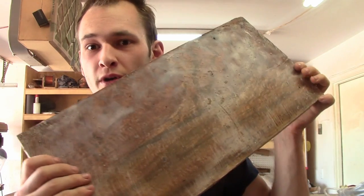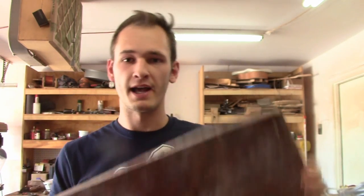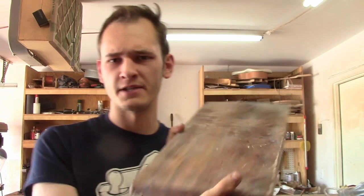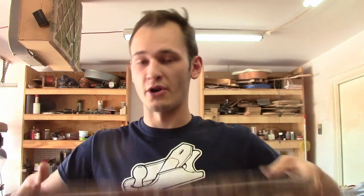This is a piece of oak burl board that I cut. You can see some of the nice burl figure. I cut this on one of my previous videos some time back and I sealed the entire thing in wax so that it is now flat. The reason it's flat is because it dries really slowly and evenly, and this way it prevents any warping or cracking. This is a nice board — it's on its way to being dry, maybe like a year or so.